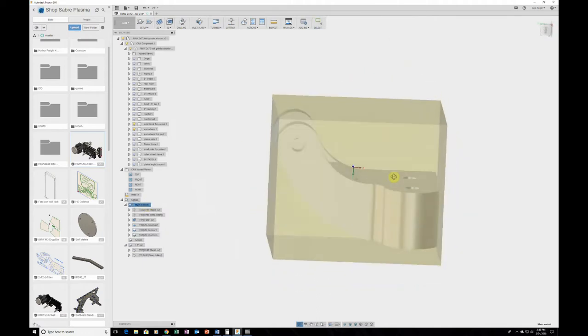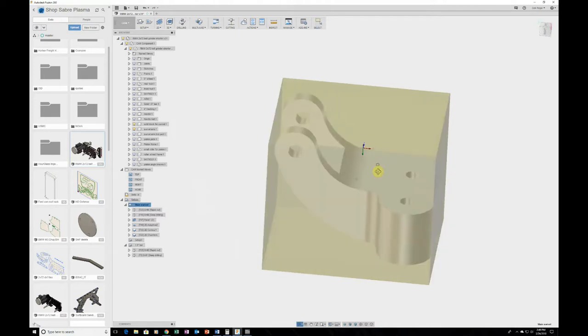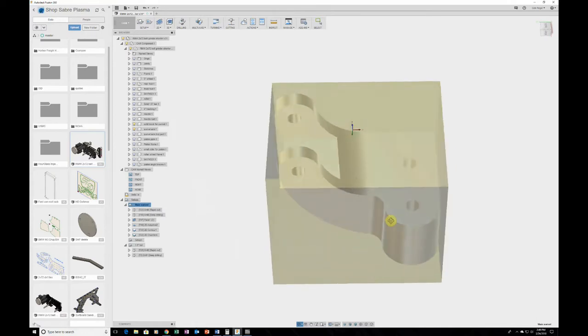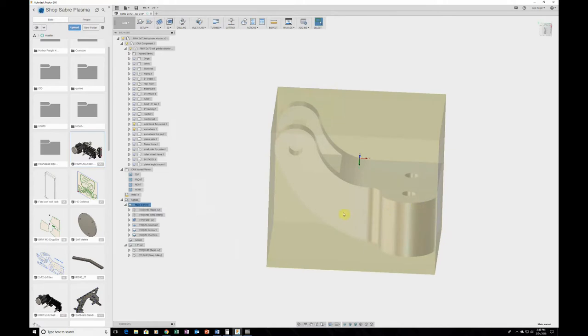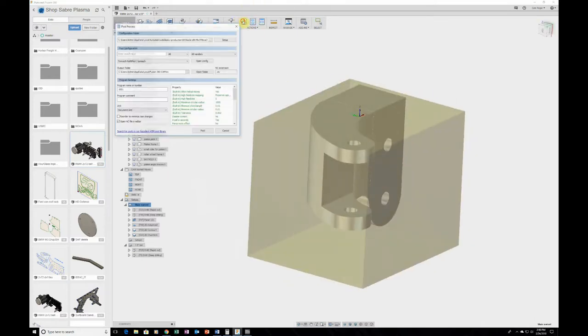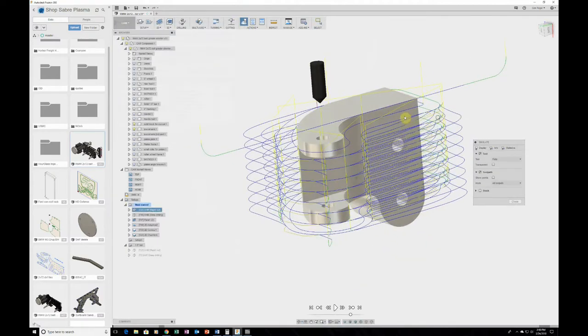And then we have to flip it this way, but we're probably going to have to make soft jaws to hold this because this material will all be removed down here, and we'll only have one good solid face. We might not have to do soft jaws to clamp that. We might be able to get away because we'll be able to machine this back part here. I don't know. We'll see when we get there. We could do a sim here if you guys wanted to see a sim. This is pretty cool. This really helps not breaking end mills and things like that.